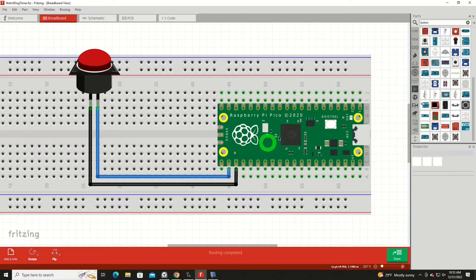We're going to look at the schematic — it's very simple. We've got a Raspberry Pi Pico, powering it with the USB port. On pin number 17, that'll go into one side of our switch. The other side of the switch comes back to a ground pin. Very simple. In the code, we'll pull it up with a pull-up resistor so it's always on, and when I press it, that'll draw it to zero and make it negative, activating the switch for us.